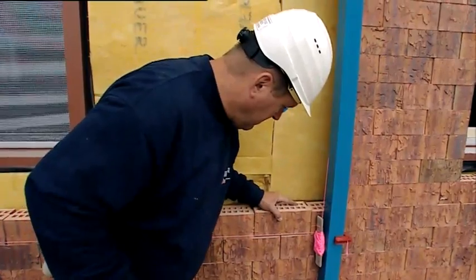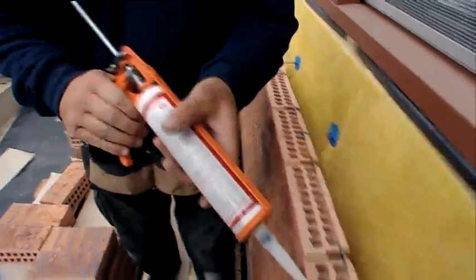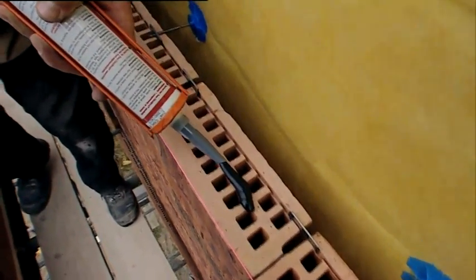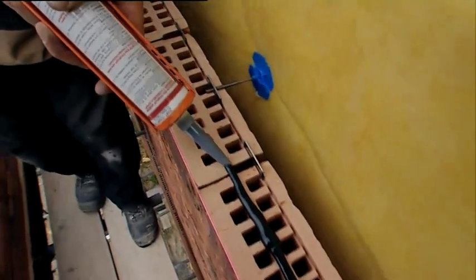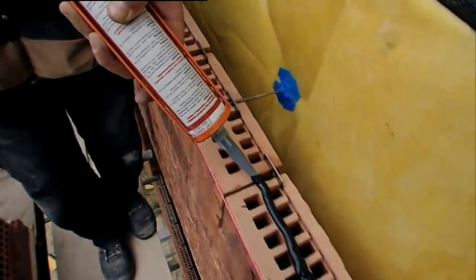All horizontal facade edges are glued. These edges refer to the 3 topmost layers below an opening in the facade and at the roof level. Gluing is done with an adhesive, the so-called click brick fix, which must be ordered along with the system. Click brick fix is delivered in tubes.